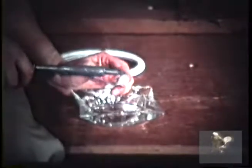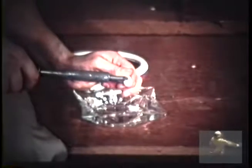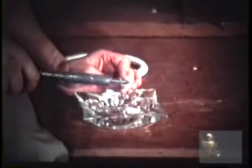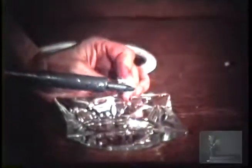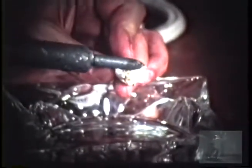With lines of synthetic fiber, the ends should be seared with a heated device such as a soldering iron to fuse the fibers together. Care should be taken to avoid a piece of hot fiber falling on your bare skin.